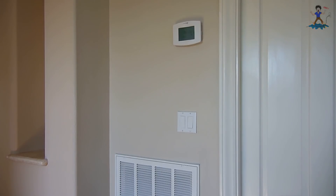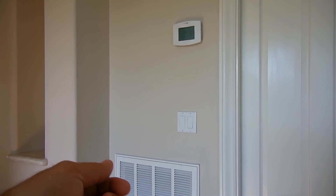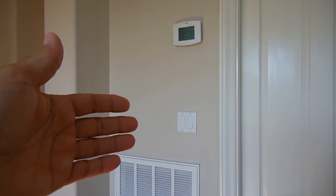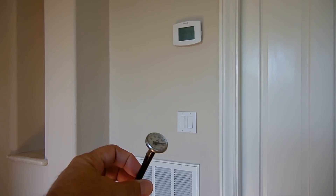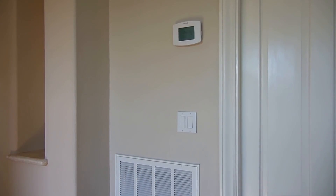The simplest thing you can do to get a very good gauge of how well your AC system is working is to take temperature readings on the air entering the system. This is called the return — it's returning the air to the air handler where the evaporator is going to absorb the heat from the air and return it to the room using the ductwork and the registers. You're going to need a simple way to measure the temperature. You can use a dial type thermometer or a digital one.